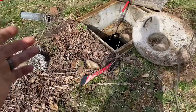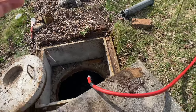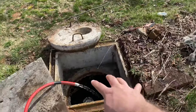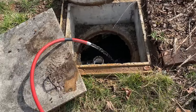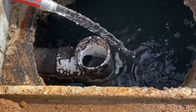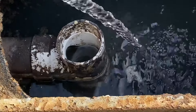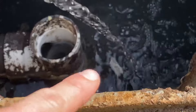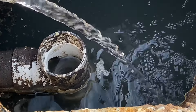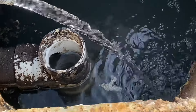The back chamber is going to be an identical version of the front chamber except it's going to be a little bit smaller. For this particular tank we've got a thousand gallons of capacity up front and 500 gallons in the back. This little fella right here — that white pipe — that's called a back baffle. That baffle's job is to keep all that floating debris from getting into the outlet line and causing a clog. You'll see that as debris floats up towards the outlet line, it cannot go past, meaning it will not clog the drain line.